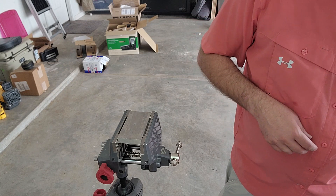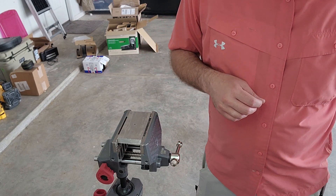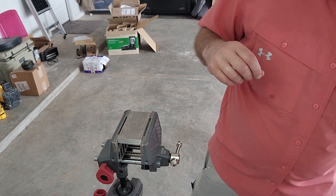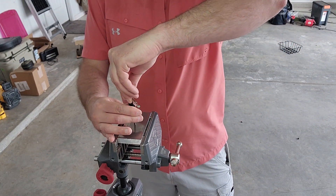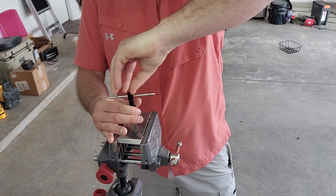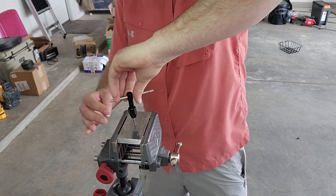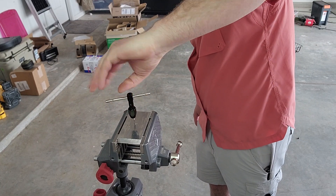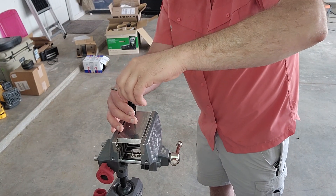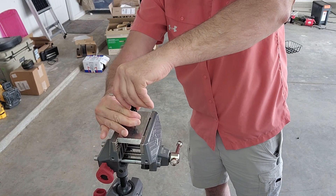Now you can use a countersink, but the screws you gave me are flat, so there's really no point to a countersink on this unless you just wanted to clean up the edges. You can literally just run the countersink in for a split second, but I don't think you care all that much. Now let's tap it — this will be the longest part because my mini mill hasn't showed up. I've never tapped aluminum before; I've tapped steel. This is way easier, except that the tap doesn't like to stay on super tight.